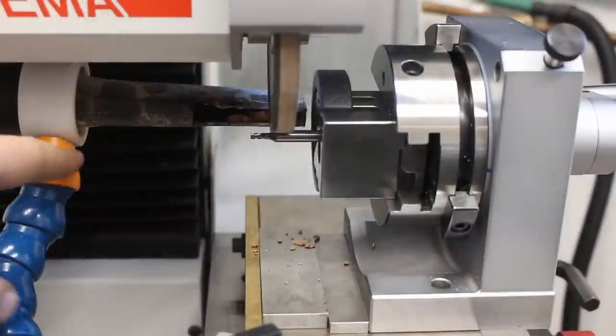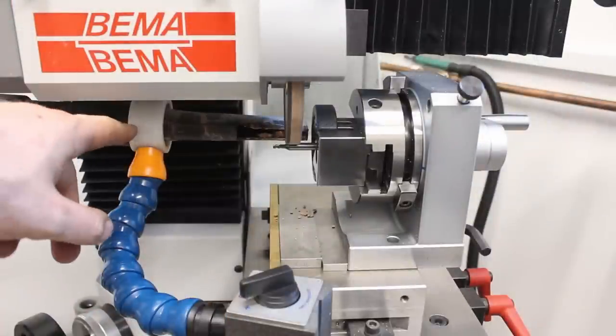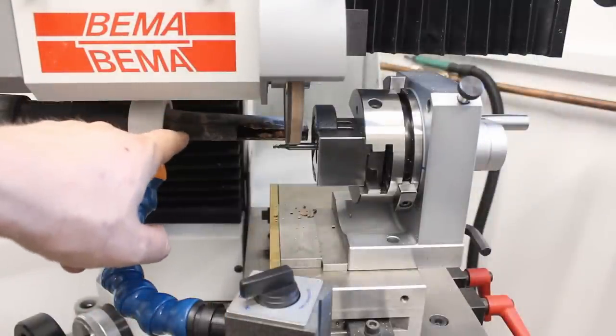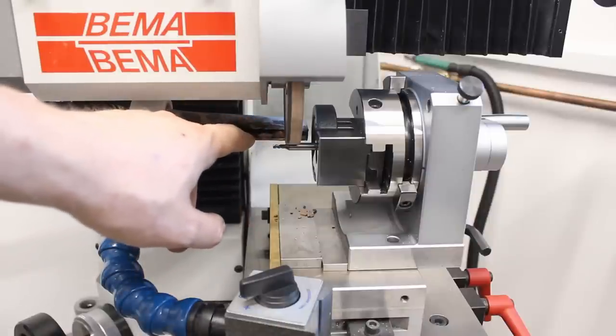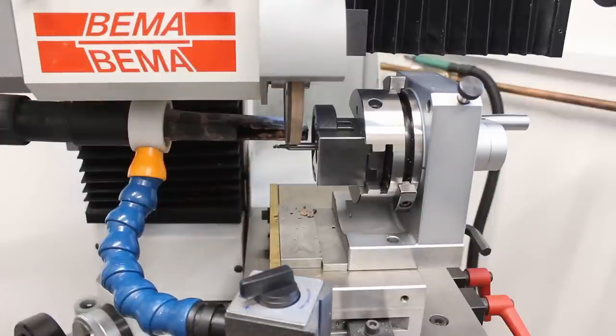go. I brought my dust extraction in, which is just a nozzle held with a Lokline arm on a mag base. Here's the mag base with the Lokline, a ring with a tapered bore, and I just put in a regular nozzle from a shop vac. This one has its opening on the side, and I welded the end shut with a piece of plastic.